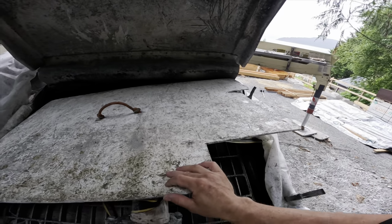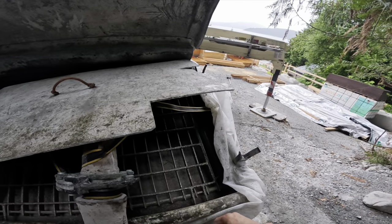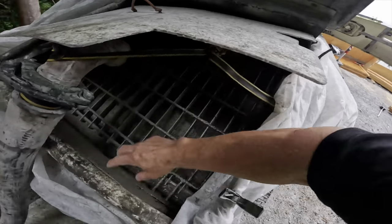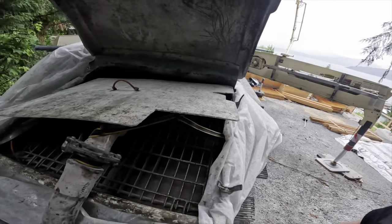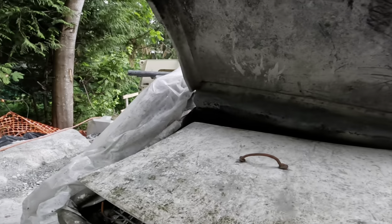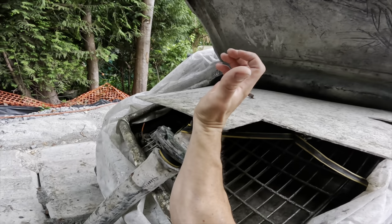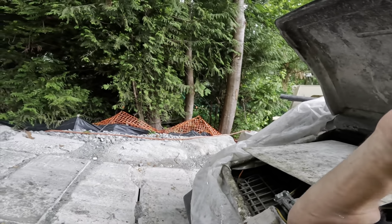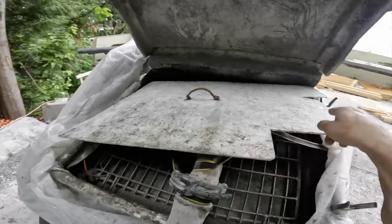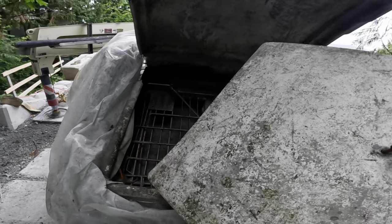So I put this board in place with a very low hopper. I'll be catching a little bit of air, but I do it nice and slow, and I can still recirculate right through this spot here. So that's why we did that. The other reason we have this little notch, and this is quite helpful as well: if you ever have a job on a busy street or you need to prime out this way for whatever reason, and you've got cars or people that way, with the little notch here,